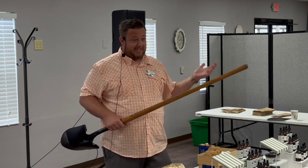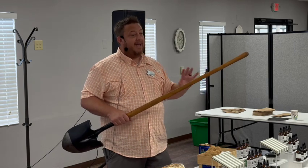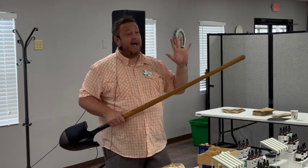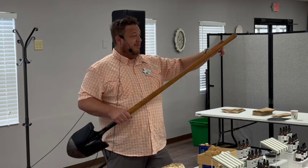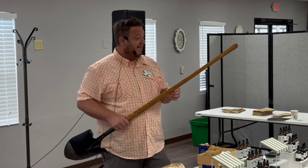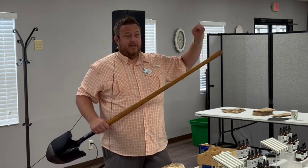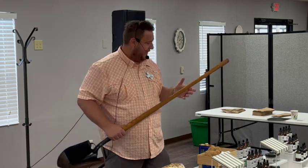Now this is best case scenario — if you skip some, it's no big deal. If you forget about it for six months, that's fine. After that, you're going to want to hit all your wooden handles annually. If you do it annually, you won't have the situation where it's drying out. But if you leave this out for a couple of weeks in this heat and sun, it's not going to be pretty anymore and it'll need to be completely rehydrated. Pay attention to the ends — the ends dry out first. Wood checks and splits at the ends first because that's where it dries out first.